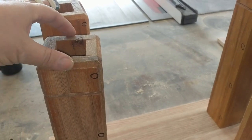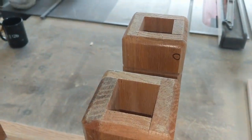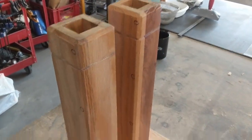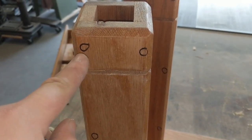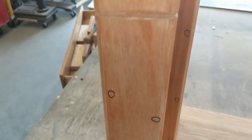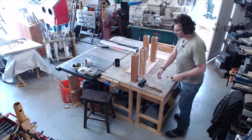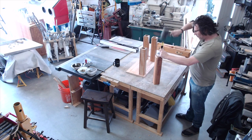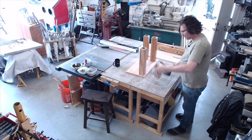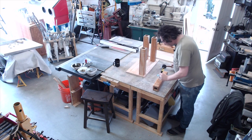I don't like it, so I'm having a ponder. What I'm thinking now is I might try to split the legs open and glue two pieces together — essentially get an inch by an inch leg that I can work with, and then have a support along here made from this material rather than having a shelf. I'll grab a chisel and hammer and see if I can get this wood apart. I've marked where all the nails are so I know the problems I'm working with. Let's see if they've been glued — well, with the nails there just to hold it and there's no glue. That is looking promising.